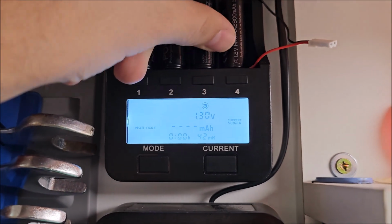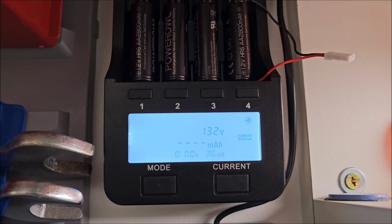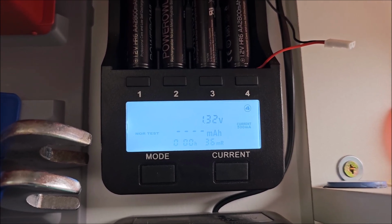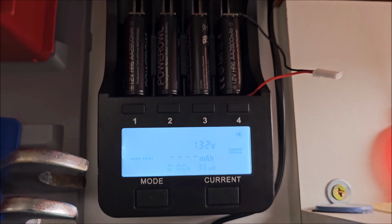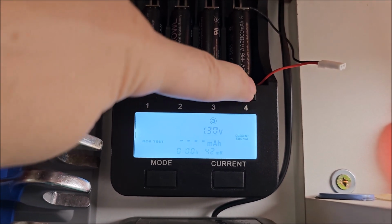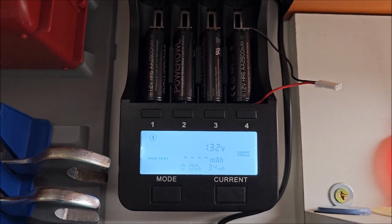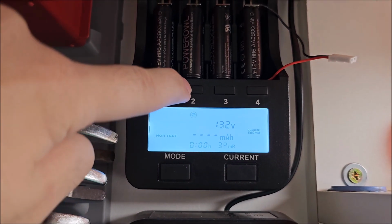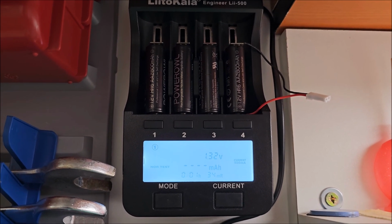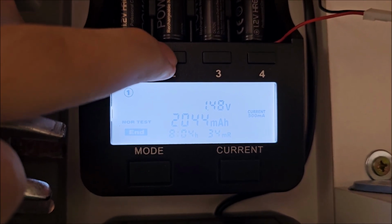We will do a few test cycles on them, because I did test some accus from Lidl, and I think only after the second or third cycle they reached full capacity. So I will do about the same for these to give them a fighting chance to show us their real capacity. In terms of charge, you can see they are about the same. And yeah, internal resistance is decently low. Let's let them charge, discharge, and show us what they can do. Okay, first test. These are the values.